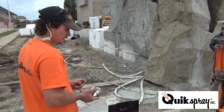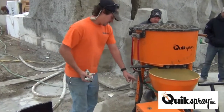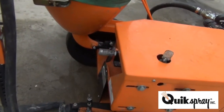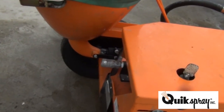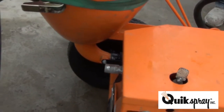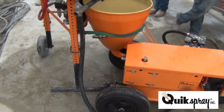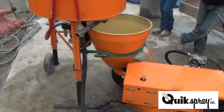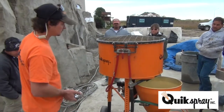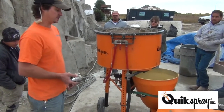This is a really universal pump. The hopper has an opening and there's a coupling on the end of the pump — this is what we call a convert-a-hopper. It allows this pump to go from one inch, to inch-and-a-quarter, to inch-and-a-half. The only thing you need to change is the material pumping line. So you can go from waterproofing to fireproofing to doing this kind of mix with an inch-and-a-half. That's what makes it really universal.